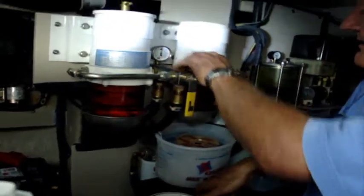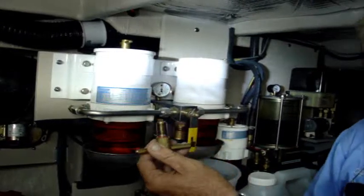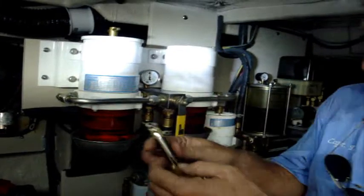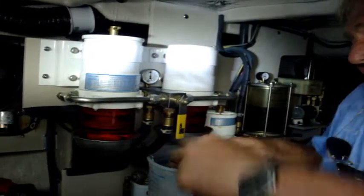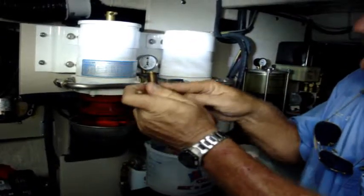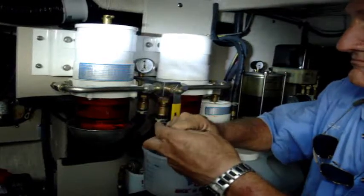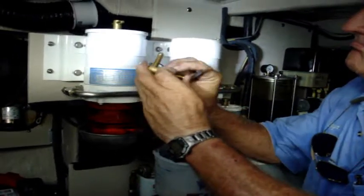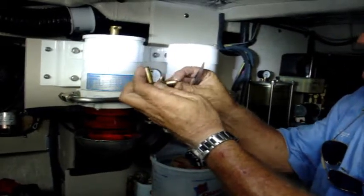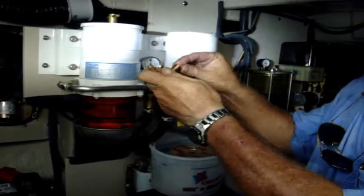Here's my T-handle. Now, you see that little red gasket — that little red O-ring right there. We want to change that out because it will cause a vacuum leak if it's split or has just been smashed too long. Got my pocket knife — there she comes. It just rolls off, and then slip the new one back on.